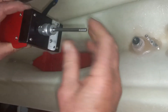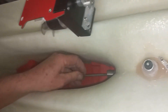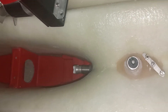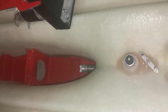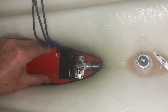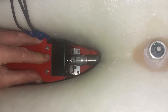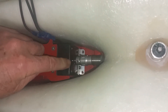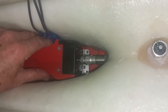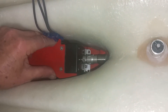So that goes in like that, with that spaced about six or seven millimetres. Put your drive shaft back. I'm showing you on this boat because otherwise you wouldn't be able to see anything if I use the closed boat. So doing it this way you get the opportunity to see how it comes together. We drop that in — obviously you don't go in front of the drive shaft — and then you work it onto the shaft like that. You can see why, if the position of that shaft had changed, there's no way on earth you're going to get that off with the coupling onto the drive shaft. So that first part was critical in keeping the position of those bushes.